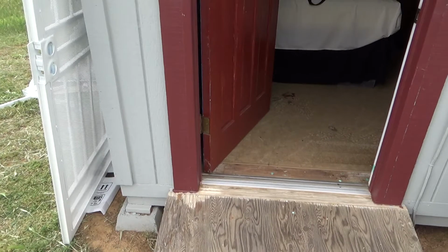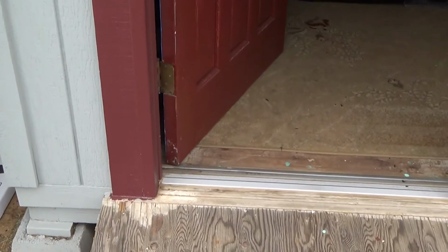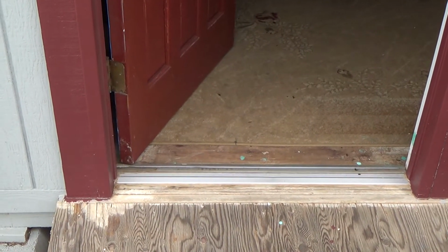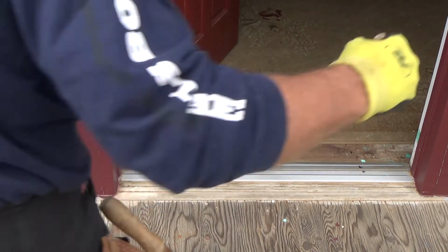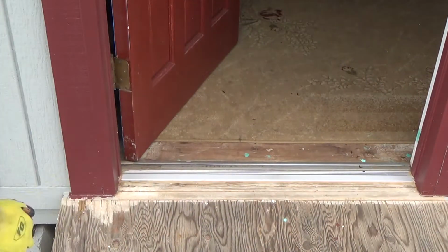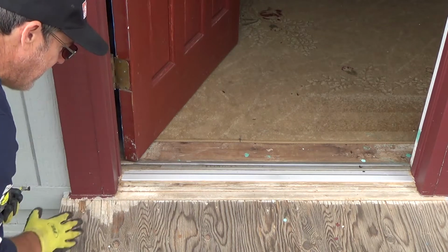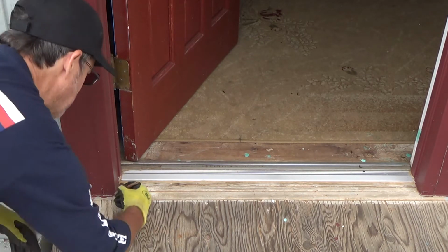Okay, now we got to go through a thought process here. Okay, here's the door jamb here. Let's get you in there like that. Okay, so what I've got to do is I put a pencil mark right straight across from this. Okay, line that up, and it's got to come out beyond 1.25 inches. Because I've got this flat area, I can do this. Now, in your door, you might not be able to, but just follow me along. Okay, so I have that.